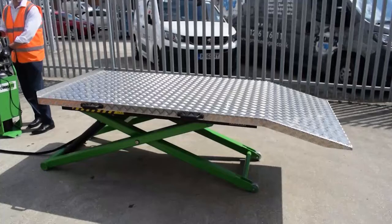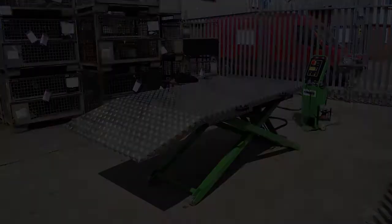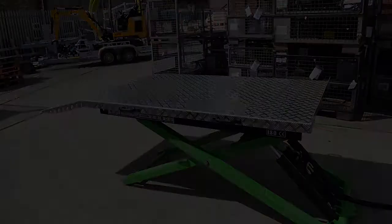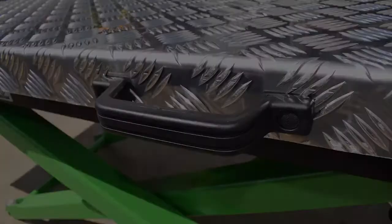You are now ready to lower the lift and load the top accordingly. It is important to note that the checker plate top should not be used for raising and lowering trailers, towable plants or any equipment that's wider than the top, causing it to straddle either side. It's been designed to be used for smaller pieces of equipment that are too narrow to be used on the main lift, enabling you to work on them at a convenient height. If you're loading anything with wheels, you must make sure that any available brakes are applied or the wheels are chocked. Ensure your load is secure and remove any possibility for your item to slide or roll off the edge.